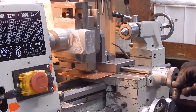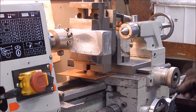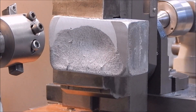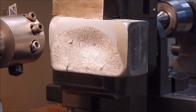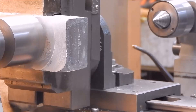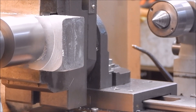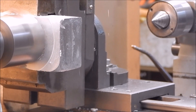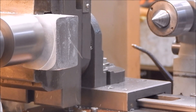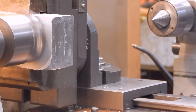You can see you haven't got that mirror finish. Okay, you can see straight away it's not as good a job as the high-speed steel. So here are the results of our labour and as you can see the high-speed steel leaves it for dead — carbide is nowhere near as good.